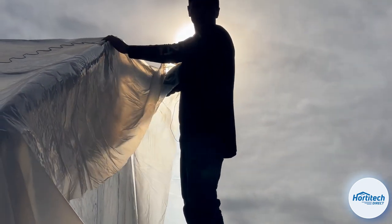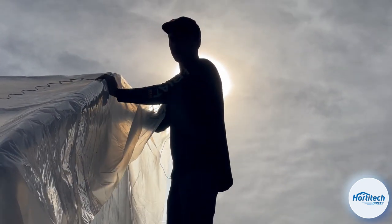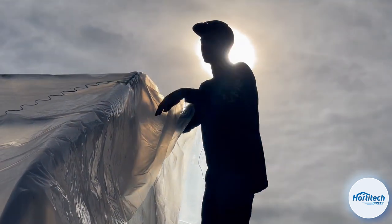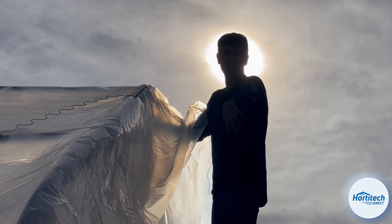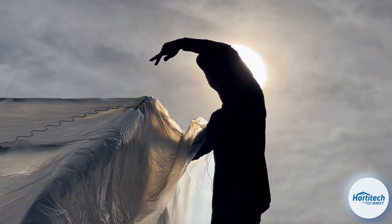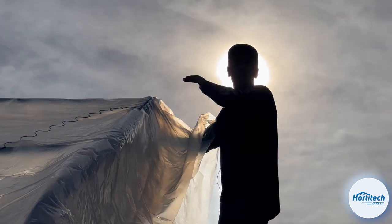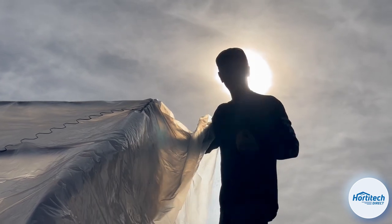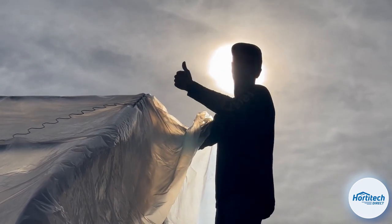Hey, Jared, let me see another wiggle. I'm just gonna get this tacked. So we're gonna tack this end first. We're gonna pick like 3 points. I'm gonna tack the peak. I'm gonna tack the side right above there. And then I'm gonna go to the other side and I'm gonna pull all my tension to that direction. So that way I get one even line on that side of the structure. Then I'm gonna come back to this side afterwards and I'm gonna pull the remainder out.